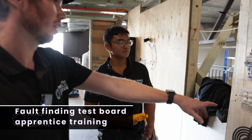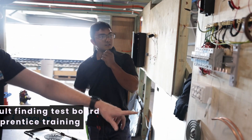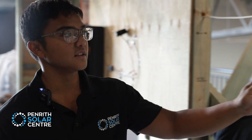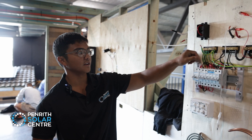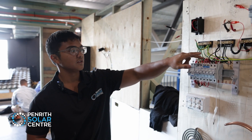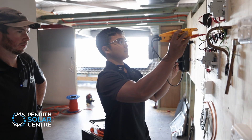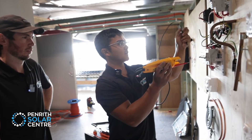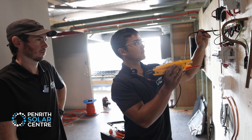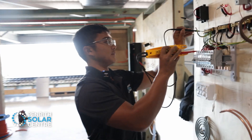These are all our test switches here. When we turn switch one on, we have an open circuit neutral. The first thing to do is test from earth to active and earth to neutral — turn off all the test switches, then test from earth to all actives and neutrals.